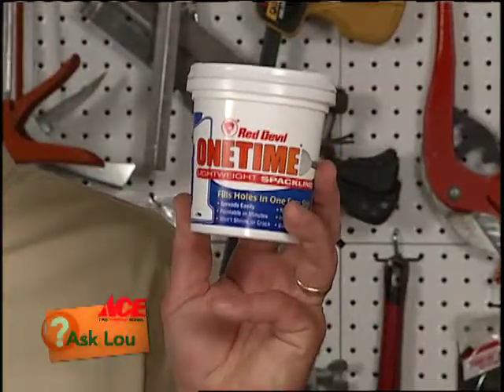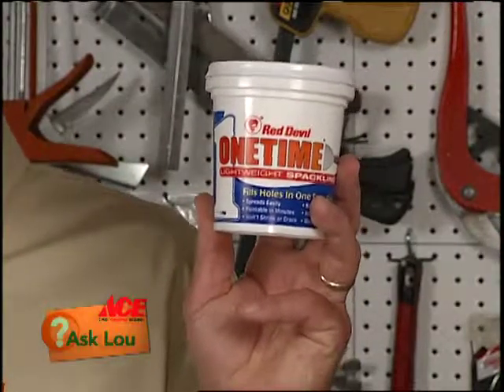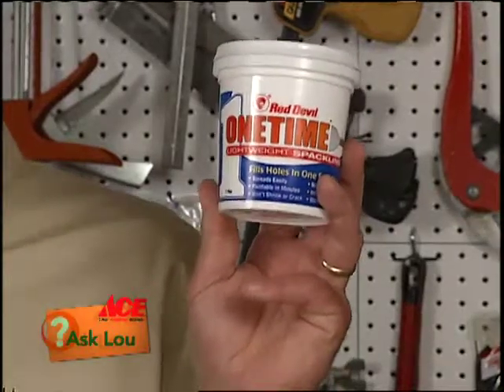Roya, the House Smarts crew told me you stopped your jog to ask a home improvement question, and I'm glad you did because paint alone will not cover up the cracks. You need a lightweight spackle like this to fill those cracks, smooth it out with a little sandpaper, and then repaint. That way the cracks won't come back.